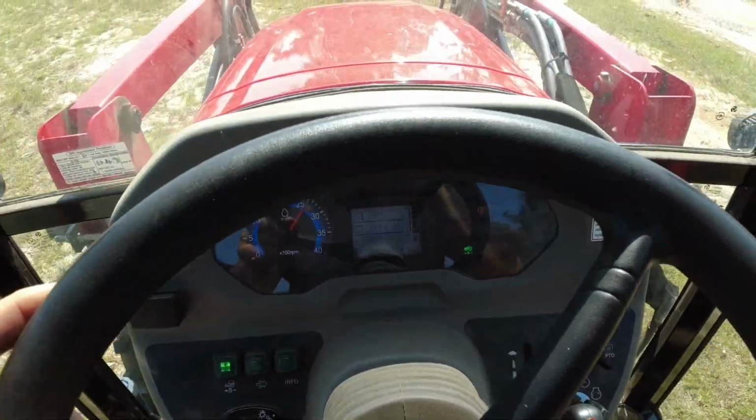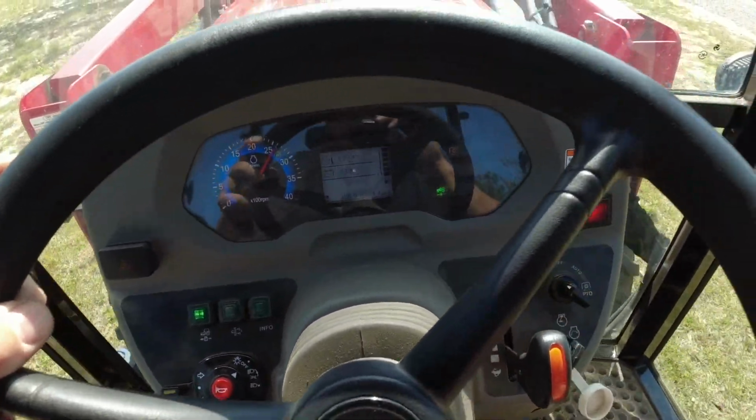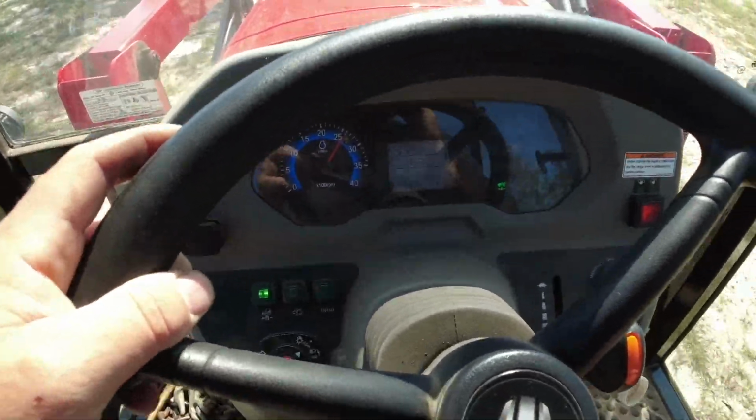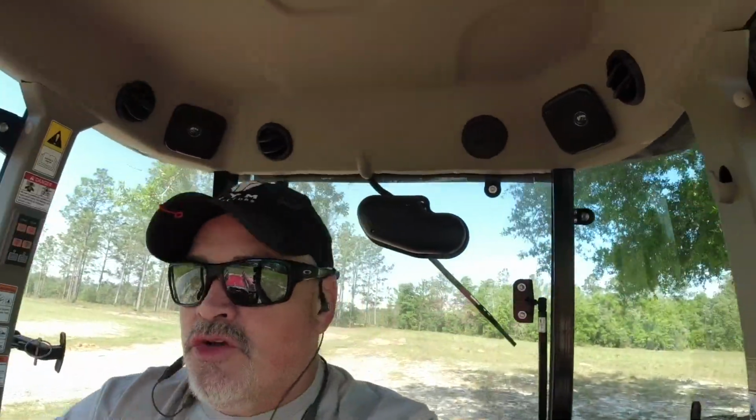Running 174 degrees Fahrenheit, 13.7 volts, 228.9 hours, 4.5 miles an hour. So one thing I did learn, that I didn't know until I was on these tractor forums, is that these are engine hours on the 228.9. And if your engine idles, it doesn't count time the same as, like, for bush hogging. I didn't know that. I thought an hour was an hour was an hour. But that is not the case.